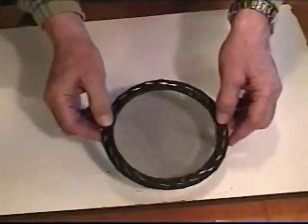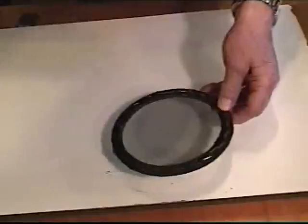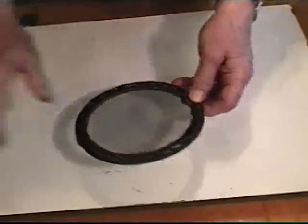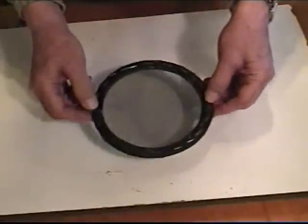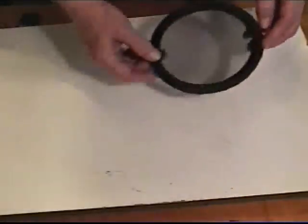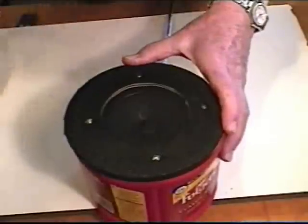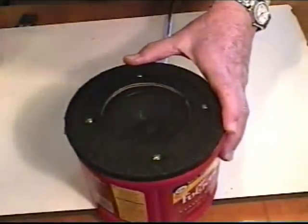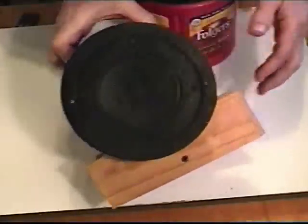Let me show you how we made the grill cloth. We took a piece of that ordinary eighth-inch Luan plywood, cut it out first to approximately the diameter of the inside of the can lid. Then we cut the screen wire out about an inch larger than that size and stapled it all the way around the edges with little eighth-inch staples. Then we mounted it on our can lid and used those same one-inch sheet metal screws — just drilled a hole through the grill and mounted it. Here are our two mounting screws holding it in.